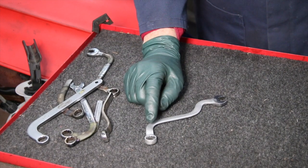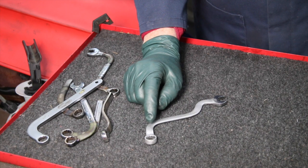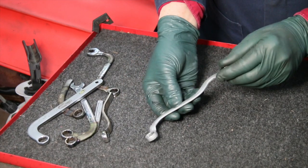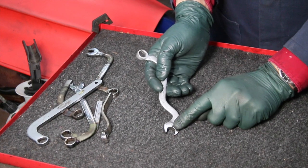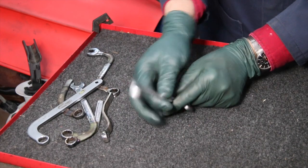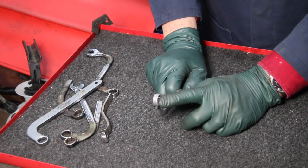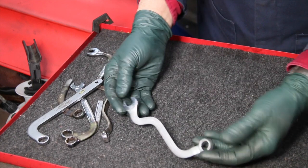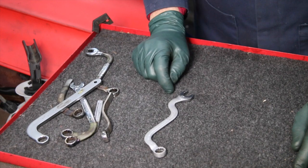And you wouldn't believe how many times we played around with a W123 240D, a W123 300D turbo, a W114 240D to make sure that this wrench would give you all kinds of combinations, even including using the open end wrench on the inboard nut on the IP pump and then having just the right angle to go underneath the back of the pump and get to that dreaded bolt on that rear bracket on the turbo diesel engines. So we're pretty proud of that wrench. I bet all of you out there say, well, you're right, Kent, I've never seen a wrench like that.